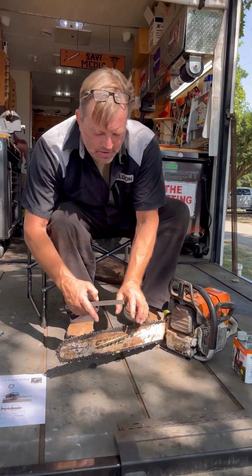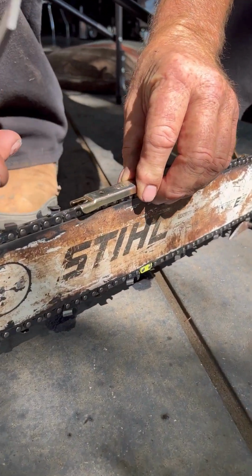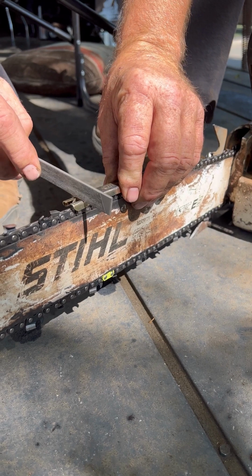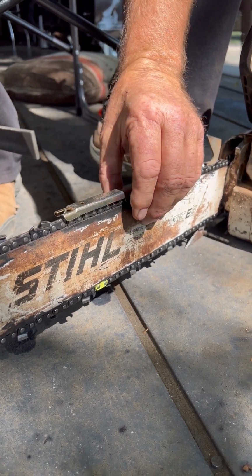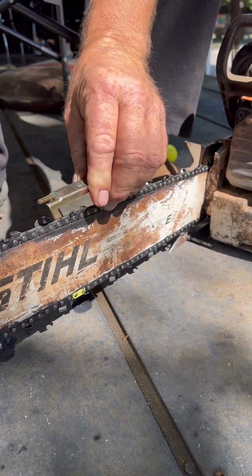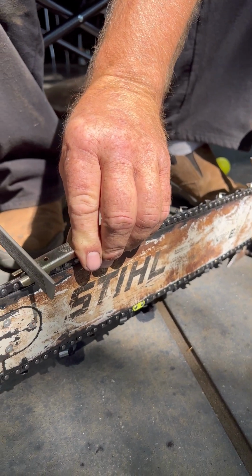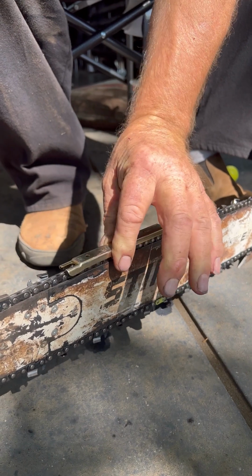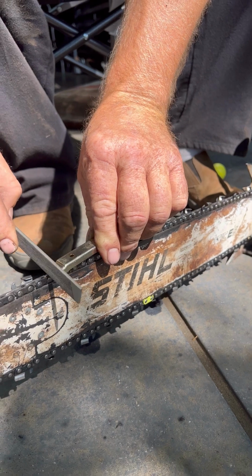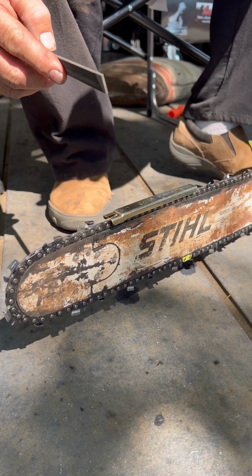You got to play with it, make sure it's hitting in this flat spot, and it's right where you want it to be. Now feel it like this. Yours is fine. There's enough gap. It's not sticking up. Okay. But if I'm going to cheat, if I put this on there and I feel it clicking, how can I demonstrate that? I thought if I raised it back here, it would do it. Hear it clicking? That means it's too high. I'm simulating it by lifting the back end, and I feel it clicking. I don't want that click. I want to file that click off to give me my gap.